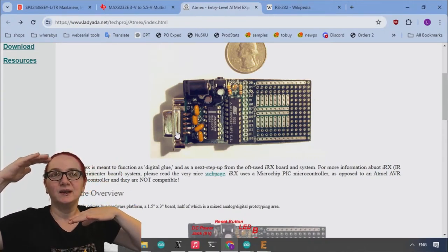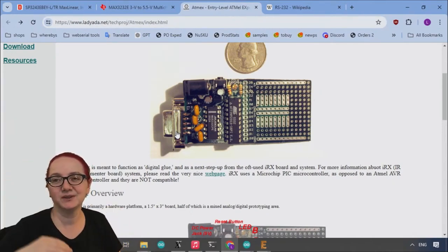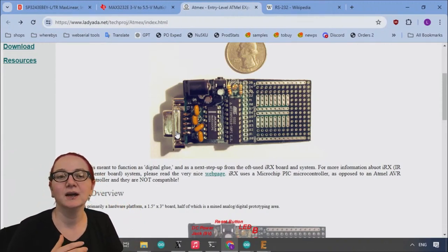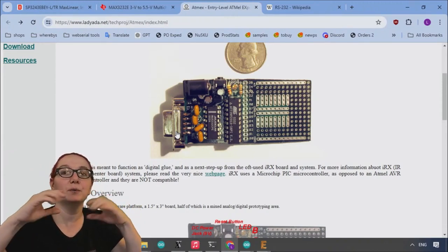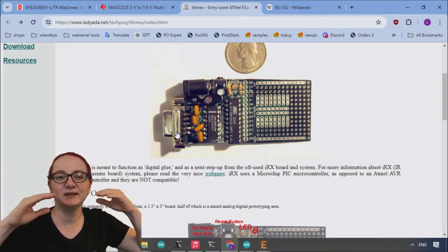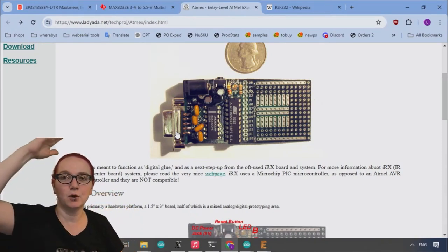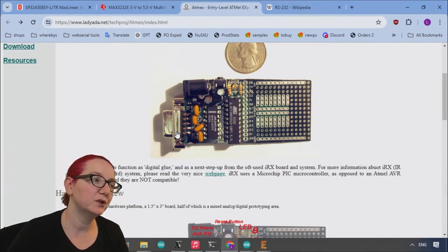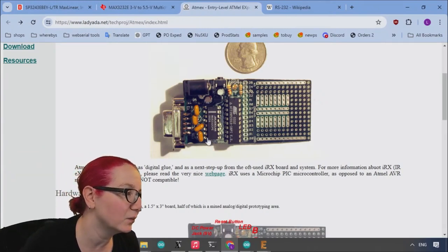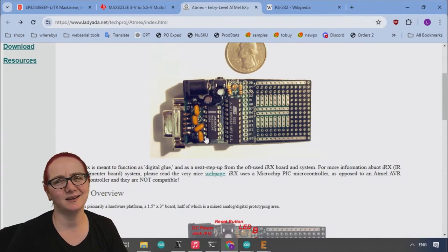The hysteresis was a little bit flexible — it didn't have to be plus or minus 10. It could be as low as plus or minus 5, with ground as the crossing point, so it definitely had to go above and below. To do that, you needed a chip, and the one that we all used was the MAX-232, the classic DIP chip.